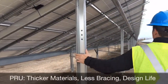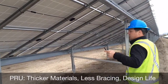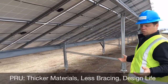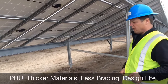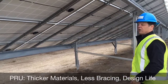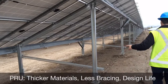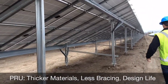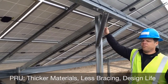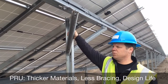The other thing I'll point out is lateral support for the rack. In some cases you've got long crossmembers in certain racking systems, which with a dual post system, when you're trying to get in for maintenance, lawn care, et cetera, you're going to be fighting with those crossmembers. With the PRU rack, the lateral support is taken up by a few short 45° crossmembers that do a fantastic job of driving lateral support into the racking system itself.